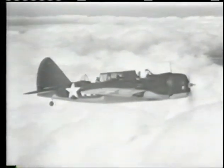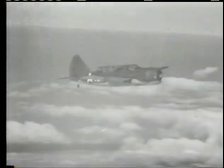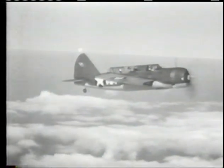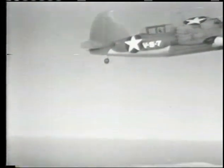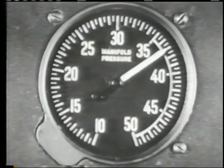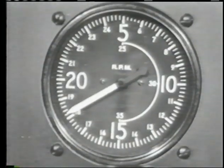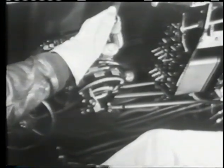In a rated power climb with service loading, the plane is slightly unstable but not enough to interfere with normal or instrument flying. For a climb at normal rated horsepower, you will be turning 2,400 RPM at 37 and a half inches of manifold pressure. You can carry this power up to 9,700 feet, where the shift to high supercharger ratio will be made. As you ascend from 6,700 to 9,700 feet, a slow, steady drop in manifold pressure will be observed. When the indicated maximum altitude for low supercharger operation is reached, retard throttle slightly and adjust prop control to give 1,700 RPM, then shift quickly from low to high supercharger. This will enable you to get 41 inches of manifold pressure at 2,400 RPM up to an altitude of 13,000 feet.